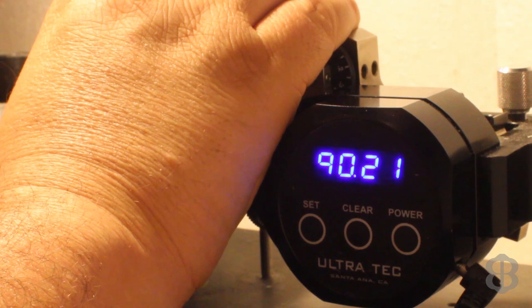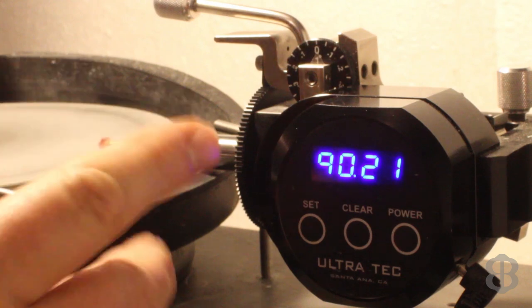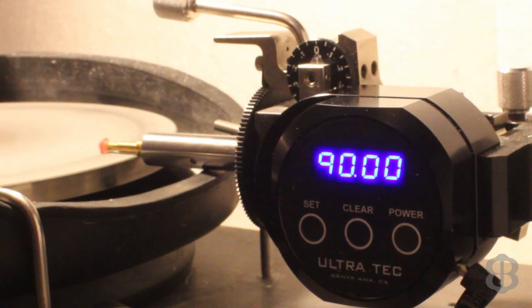we'll cut one row of our girdle and have a real good idea of the width of the stone when we're done. We started with the 96. The stone touches the lap at 90. So if we were to start with this one, we would probably grind down a little bit, go all the way around every 6 teeth, get to the 90 tooth, and it wouldn't even be touching the lap.